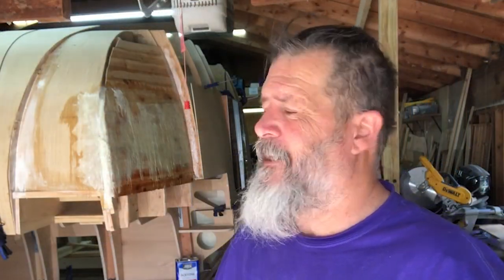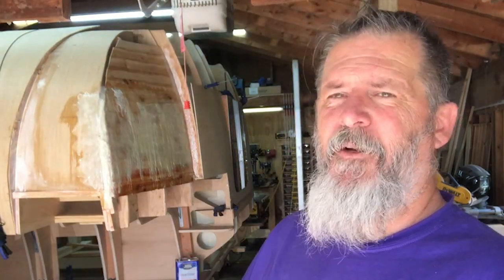I kind of get it that a lot of people haven't done fiberglass. I'm no expert by a long shot. But I purposely wanted to show you, you really can't screw this up. What I mean by that is I took some fiberglass, and when I started, it was a little bit cold. And the stuff flashed, which means it starts to set up or harden unexpectedly. So, I mean, it had set there for probably 20 minutes. It hadn't flashed. This particular mixture, I had thickened it, and I really wanted it to start to activate a little bit so I could use it as a bit of a filler. But when it started to go, I thought, you know what, I want to make this an educational moment.